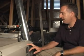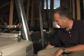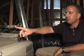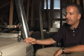In this case, we've got the heating element up here. It also works the fan for the air conditioning unit up here. So I'm going to be taking a look at the drip pan to make sure that the condensate lines are connected. I'm going to take a look to make sure that the vent piping is all good. Also, we have the gas line that's coming in for the heating unit. I'm going to make sure that's correct.